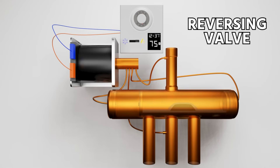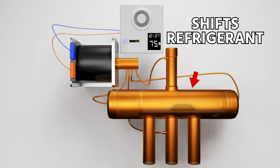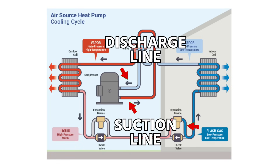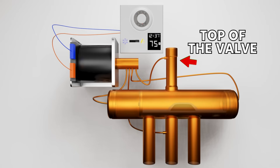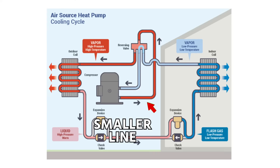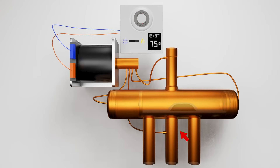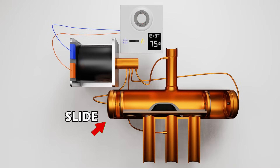Let's go through the reversing valve itself. The reversing valve is made up of two primary parts: the valve that actually does the shifting of the refrigerant from indoor to outdoor coil, handling both the suction line and the discharge line. You'll notice that the refrigerant comes into generally the top of the valve — the side that's by itself — the smaller line, which is the discharge line, or what we call the common or always discharge line, meaning it's always the discharge line. The center between both sides is the always suction line, or common suction line, and you can see how the slide inside this valve operates.